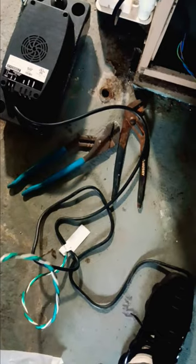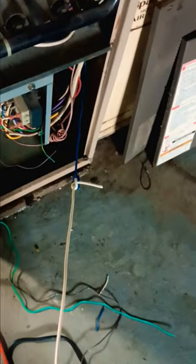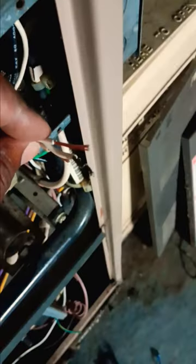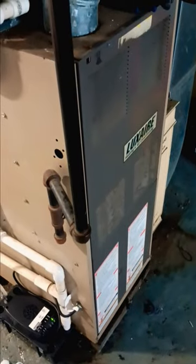I cut the plug off, gave me enough room so it could stand all the way around in there, just like they did — because that casing, I guess, is a fire hazard, so that's why they didn't do it that way. So I'll tie this together, pull this wire up through the furnace, put that neutral together just like that — bam.